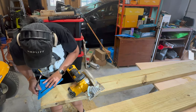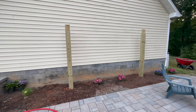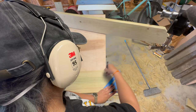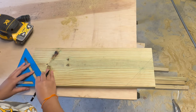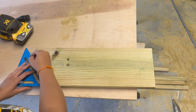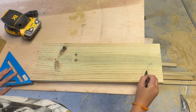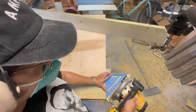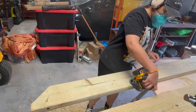It is another day, which means it is time to finish this project. Our concrete is solid and now covered with dirt. The next step is to add the decorative cuts to our ledgers and the four decorative pieces on the side. To make our decorative cuts, we're going to measure three inches down from the top, then use a speed square to cut at a 45-degree angle on both sides. We originally got ledgers that were 12 feet long, but the decorative angled cuts made it a little bit shorter than we originally wanted, but that's okay.